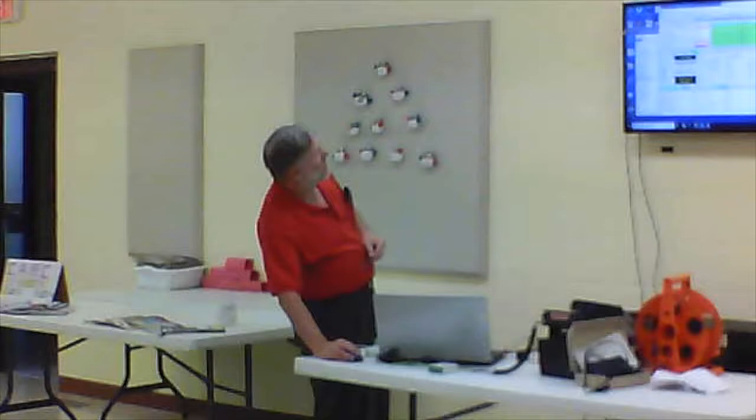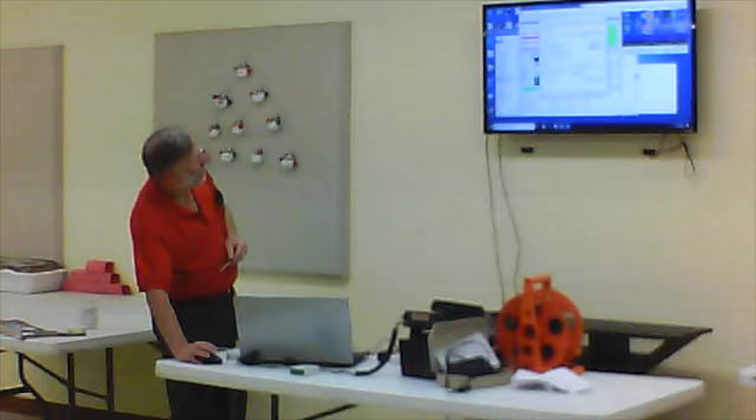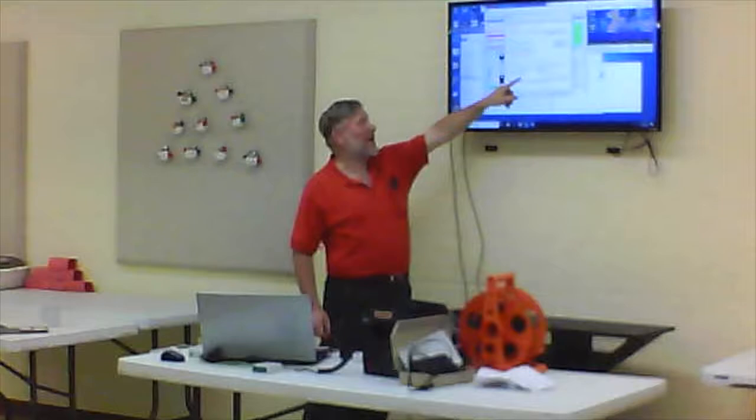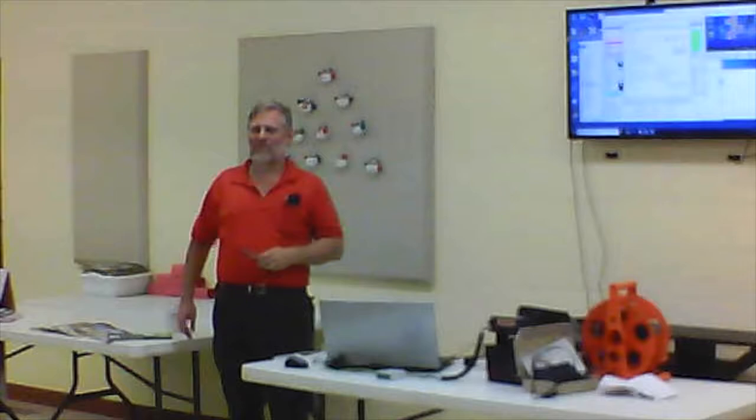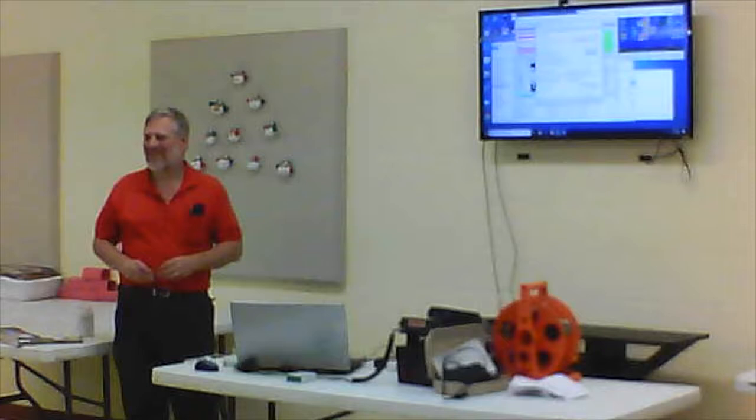Something else I should mention was a setting, because one of my first conversations was really fun. Let me find a setting here. Right here. This box is normally not set when I install software. It says disable transmit after sending 73. Well, I made a QSO with the guy, and all of a sudden, 30 seconds later, it was sending 73 again. Didn't he get it? I finally realized I had to manually shut it off because it just kept sending 73 over and over and over again.